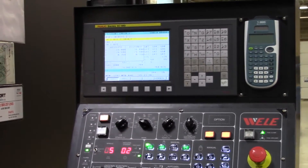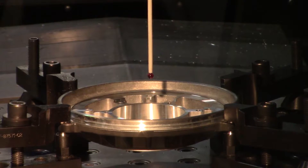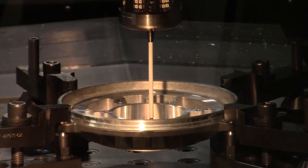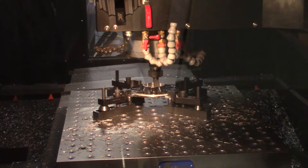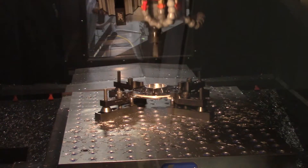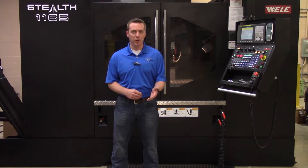The initial bore making room for the sleeve, installation of the sleeve, and then the final bore. This saves a vast amount of time compared to the old process of performing this style of repair on a lathe. This machine takes all of the human error out of the machining process and this saves money on costly rework.